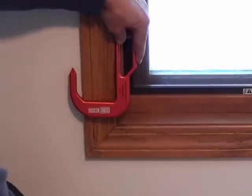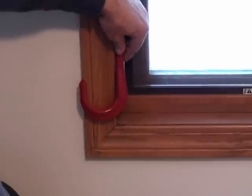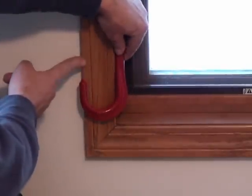Along with this, if the hook would shift, it can catch the lip of the framework, preventing the hook from completely sliding out of position. In contrast, when you look at the Crosby, it doesn't have the width to get around the framework and the point ends up being right on the edge.